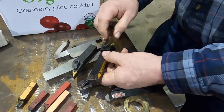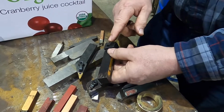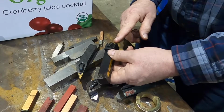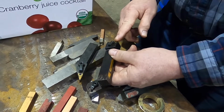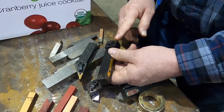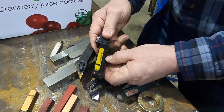But the U's will vary more in where your cutting edge ends up when you rotate it. Okay. So instead of changing your size by 2/1000ths of an inch when you rotate it and it's a little dull, it might change by 5/1000ths of an inch. But if you're ripping off material that's only got to be within a 1/16 of an inch, it doesn't matter. Right. It's a cheap insert, use it up. Or it was supposed to be a cheap insert.